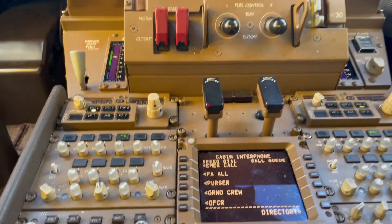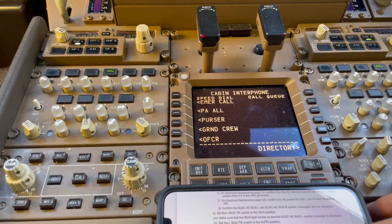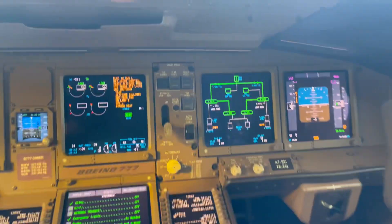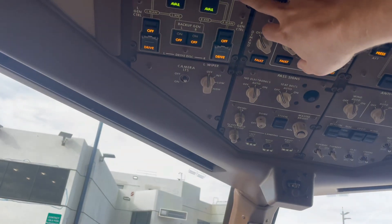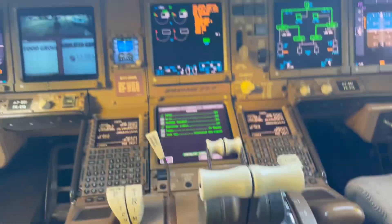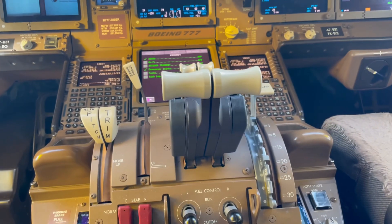Set left to ISO — there you see, go to ISO. The AC bus left caution you see there on the top. Re-engage it again — we are green again. And we'll do that with the right one. Right AC bus — engage again. All in auto, all in auto. All the warnings on the buses are gone.